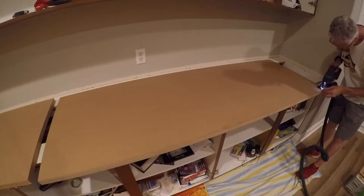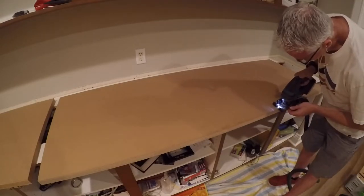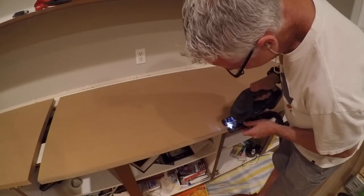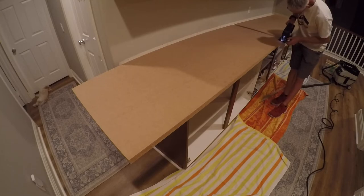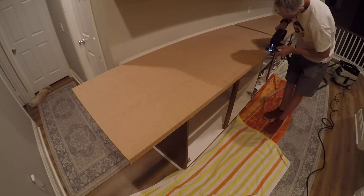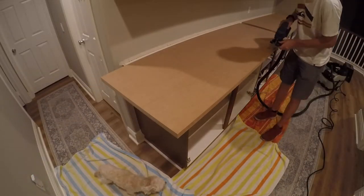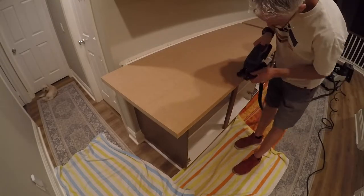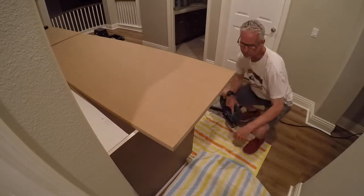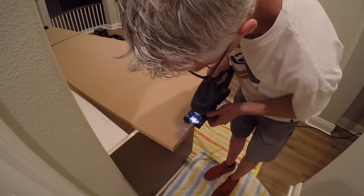To position these I have to switch their position so I can trim the right edge. I put a little drop cloth on the floor. As I cut this with the jigsaw I'm leaving the line and tilting the jigsaw back just a little bit so the cut is slightly tapered. Going through two batteries, I cut all this out and it looks very nice, but it does take a little bit of time. With dust collection it's very nice — the dust just drops a little bit on the floor on the drop cloth, nothing on the surface or in the air. This dust collection system works great with this jigsaw. On this side part my scribe line was not dark enough and it actually came off a bit, so I was having difficulty seeing the line.